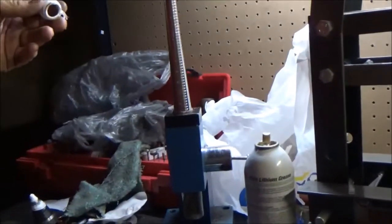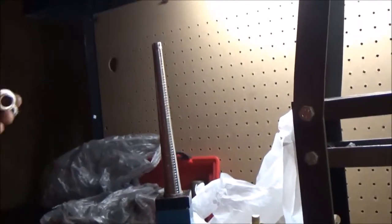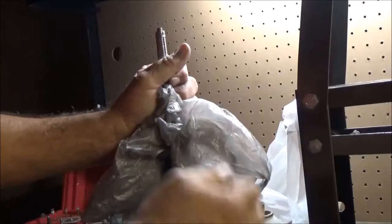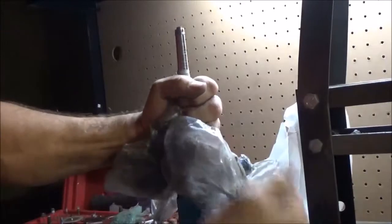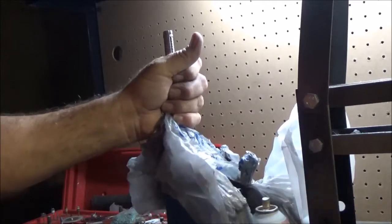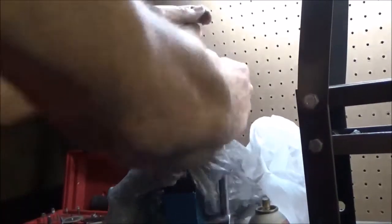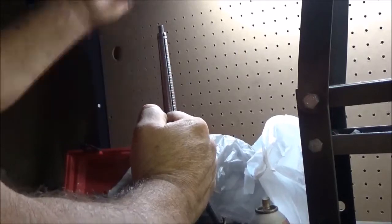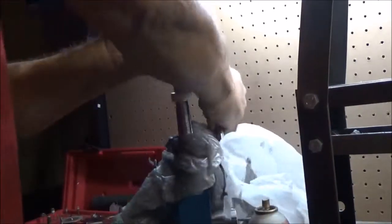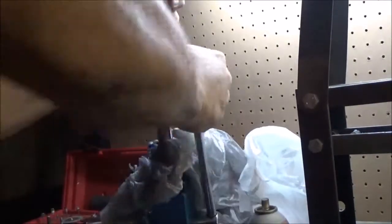Come back over to the ring mandrel stretcher. I'm not even going to take the tape off. I'm just going to put the ring on there. We're going to bring that side within a quarter of an inch of our desired size. And if you don't go down too far with it, you can get up here with it. Do some real stretching. Looks like it cut right through the bag there. That inner part of that lip's going to be removed anyway. As long as it's not touching the inner detail, we're okay.